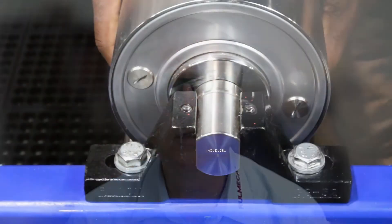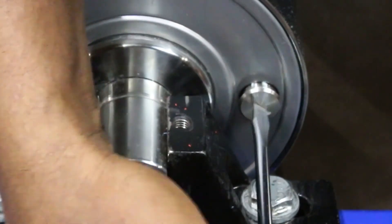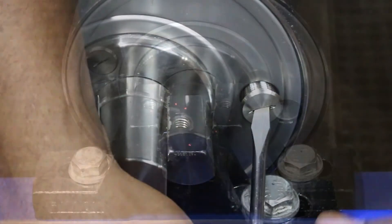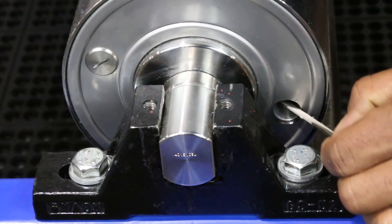To check the oil quantity, use your company's lockout tagout procedures and then rotate the pulley until the two oil drain holes are at the 4 o'clock and 10 o'clock positions, as shown here. We have both full stainless steel IP69 and carbon steel construction available, and this procedure is valid for both configurations. Remove the lower oil plug, and when properly full, the oil level should be approximately at the bottom of the lower hole. You can either look through the lower hole or use a clean wooden stick like a dipstick to verify that oil is at the bottom of the lower hole.